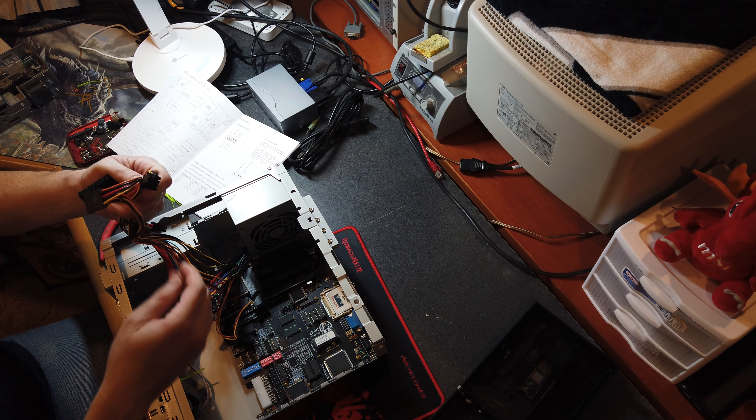I'm going to put the multi-IO card controller here. I think I'm going to disable COM2 if that's possible. Looking at the manual: CN1 serial connector 1, one printer port, one serial port COM1 or COM3, one optional serial port COM2 or COM4, one game port. COM1/COM3 and COM2/COM4 can be selected. Selectable printer interrupt signals IRQ7 LPT1, or IRQ2 or IRQ5 LPT2. All functions can be enabled or disabled.